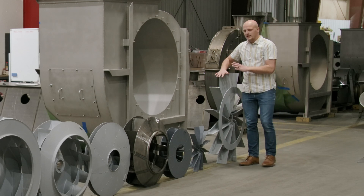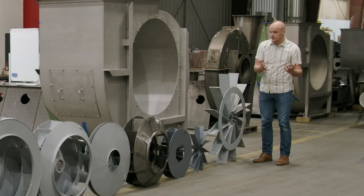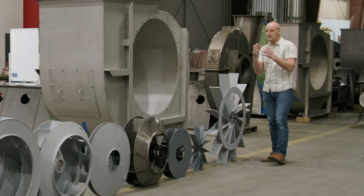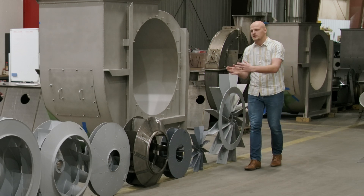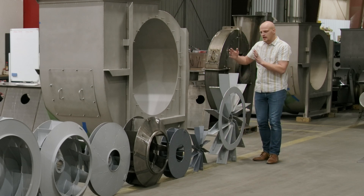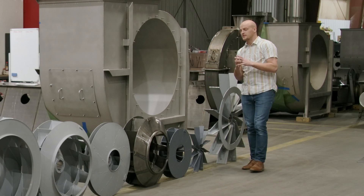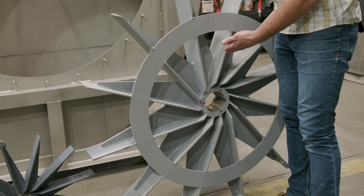The second question is: what performance do you need in terms of the application? Is it moving clean air, saturated gas, abrasives in the airstream, or maybe light particulate loading through the fan? Given those different characteristics, you'll choose a different wheel. Also consider volume and pressure: high volume and low pressure points you toward the more efficient fan types in a clean air application, while high pressure and low volume means you go toward the pressure blower types.